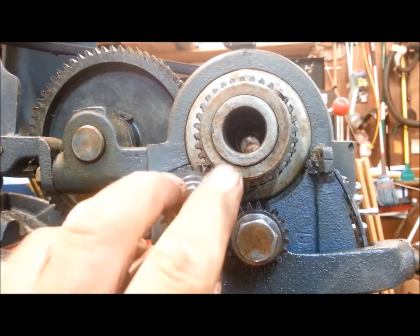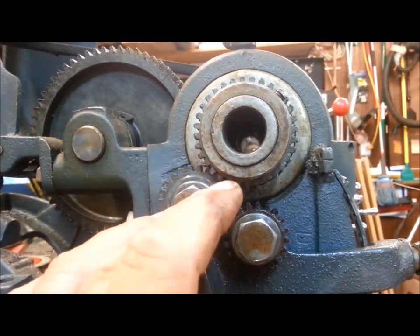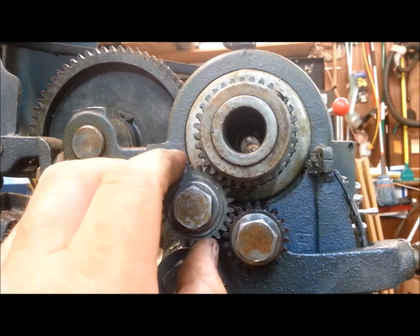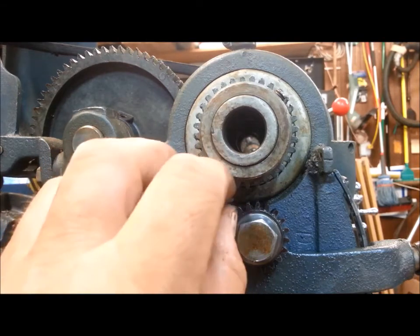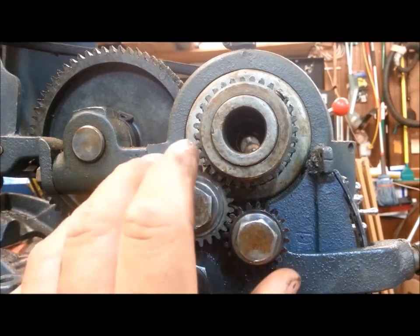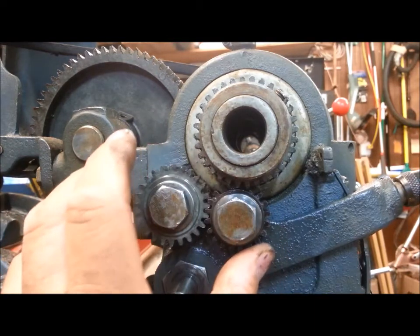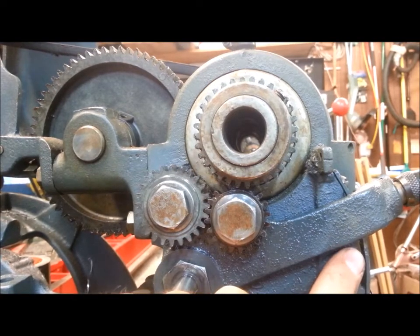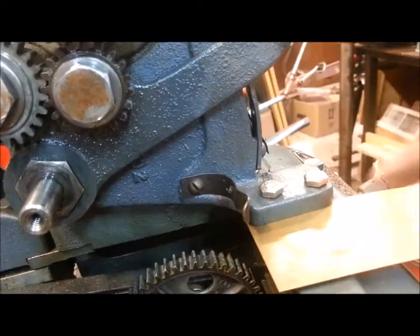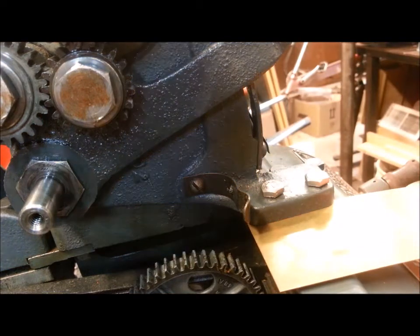The problem we had before is that as you move the gears away, the transfer of force — gears are really levers — is less linear. What I mean by that is there was a buzzing, a zzzz kind of sound. This was caused by acceleration and slowing down, acceleration and slowing down. These gears were basically just touching at their tips. This has really closed things up quite a bit. I can see I've got a little more lash in this tumbler than in this one, so I'm going to move the gate slightly later on and split the lash between those two, which is really the only thing this adjustment makes. Meanwhile, I've got to cut out my shim to fit this foot pattern here with a couple of holes in it, and we'll get this fixed.